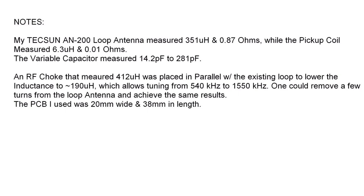I wanted to leave the integrity of the windings in place, so I elected to add the RF choke, knowing that it would impact the Q — but we have the Q-multiplier circuit that we'll review now.